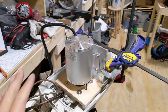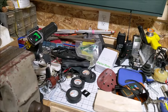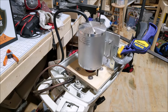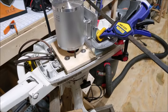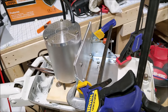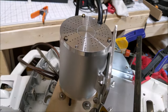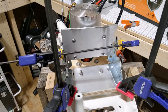It looks a little bit off, but it's really solid at this point — the clamps are holding it. If we go to the throttle... that was probably about 60 to 70% throttle. I don't want to go too high because we just have this clamped right now. The next step is to run these bolts through and really get this secure. Originally I was going to have the angles in the center, but because of how it was welded on at a slight angle, this way is better. We didn't have enough clearance on the sides, so let's get this bolted down.